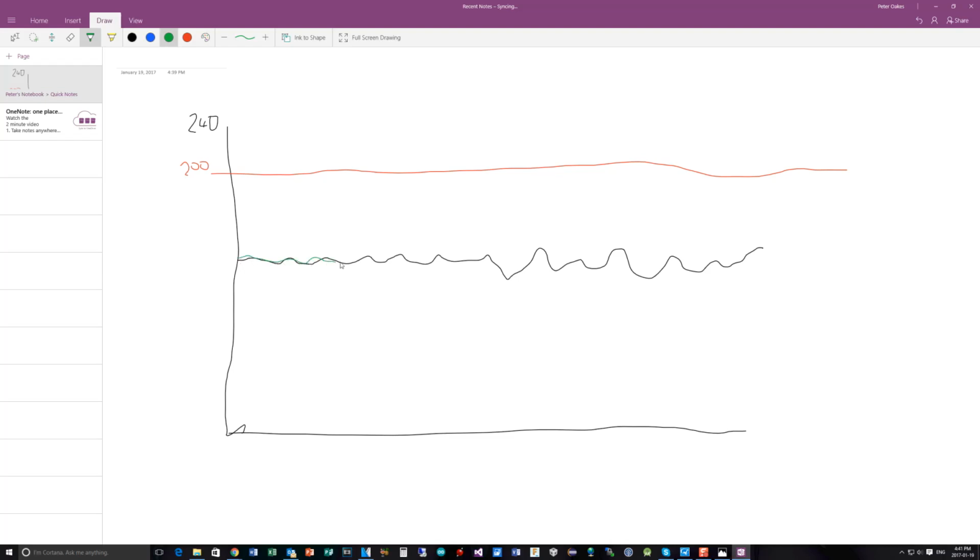So you're coming along, the black one is maybe the previous month, and the green one is now the current month, and you've now noticed that it's starting to do this on the power consumption. It hasn't hit that magic limit yet, but what that could indicate is that the power supply is starting to provide more and more power to the motor, and this could be caused because maybe the motor is wearing out. The bearings are starting to get dry or worn, and it's requiring more power to maintain the speed, or whatever it happens to be driving, or something associated with that.